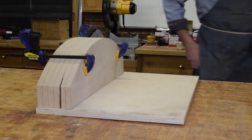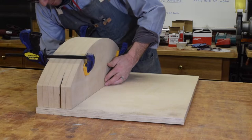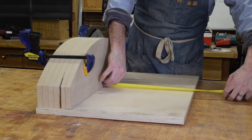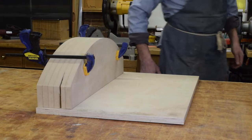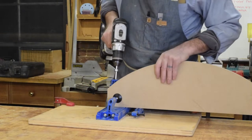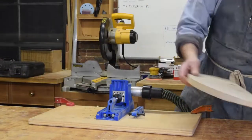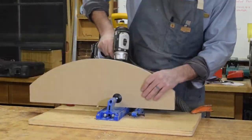With the ribs cut it's time to start assembly. I'll need a platform to build the form on — make it wider than the ribs by about an inch and a half and a few inches deeper than your finished panel. I'll also need some spacer blocks to put between the ribs. Measure the difference between the platform and the ribs and divide by the number of spaces. If this number is more than three inches you'll want to add another rib. I like to use pocket hole screws to assemble jigs and fixtures — it's efficient and strong and I don't have to lay anything out. I'm using a Kreg system jig here to drill out the pocket holes.